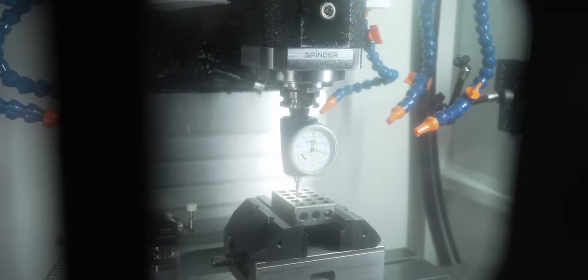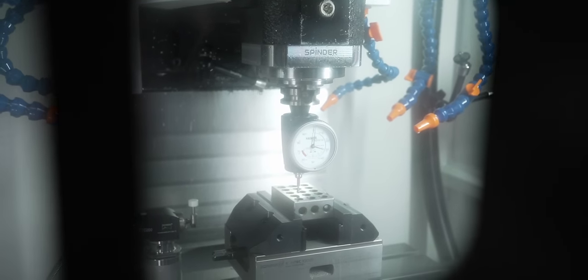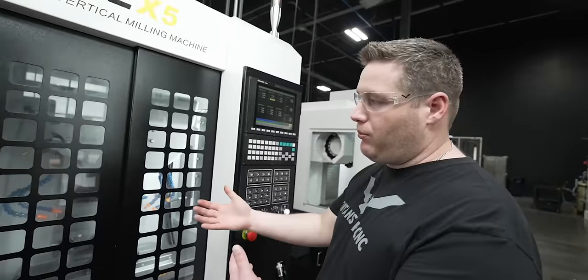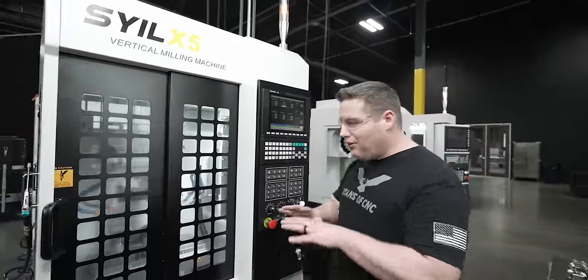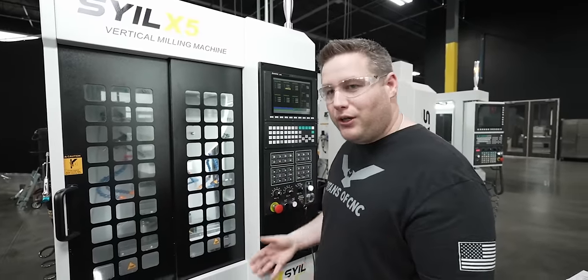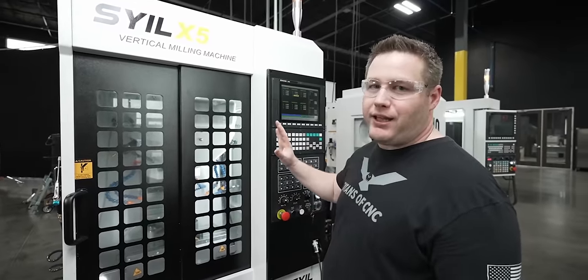I'm gonna shift it down 1 inch. Now I'm just gonna shift it back up 925. Obviously I could have touched that off and said -75 thousandths and that would have been right. But I like to keep things as simple as possible, knowing that I ain't gotta do any math that could create some user error and completely eliminate that from the scenario.